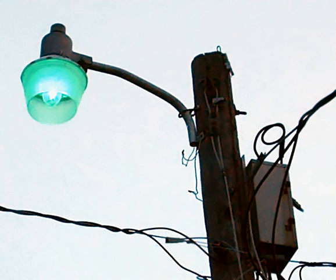Topic: Ultraviolet hazards. Some mercury vapor lamps, including metal halide lamps, must contain a feature or be installed in a fixture that contains a feature that prevents ultraviolet radiation from escaping. Usually, the borosilicate glass outer bulb of the lamp performs this function, but special care must be taken if the lamp is installed in a situation where this outer envelope can become damaged.